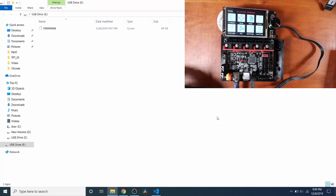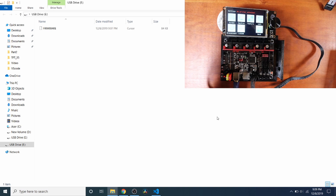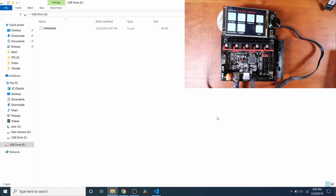Keep in mind, because we don't know what the speed is, I'm going to click on Settings. Right now it says 115,200 but we're at a quarter million bits. I'm going to click on that — and there it goes, it does fix the situation. If you like this tutorial, please press the like button and subscribe. Thank you for your time.